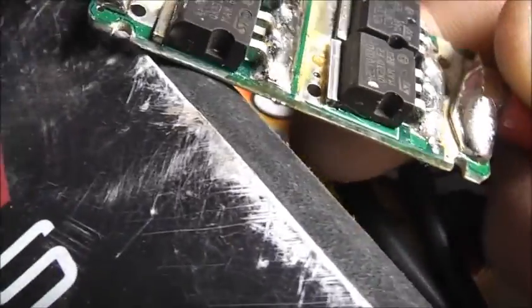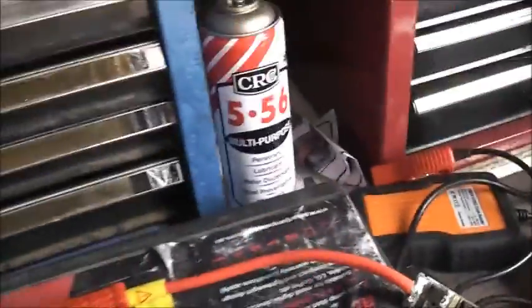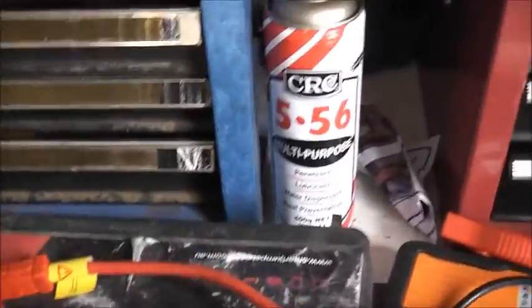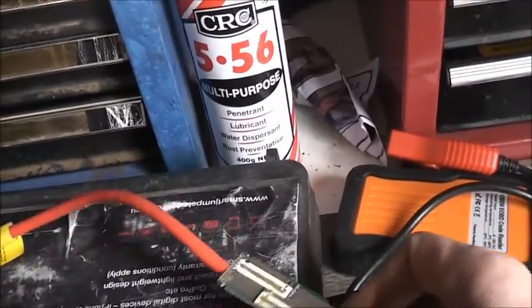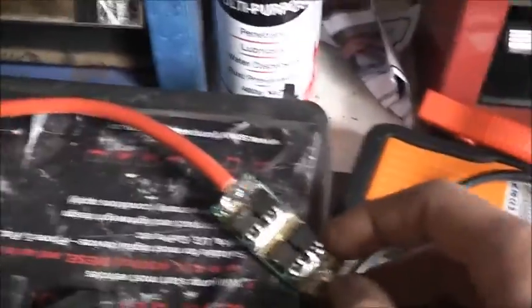They're not physically damaged — you can't see any damage, burns, or holes in them. But yeah, they're blown. So you've got 40 amps each, 1, 2, 3, 4 — that's 160 amps worth of Schottky diodes. They were the protection circuit. They failed open circuit in order to protect the battery from thermal runaway. As I said, you don't want to damage those batteries. So I've ordered replacements.